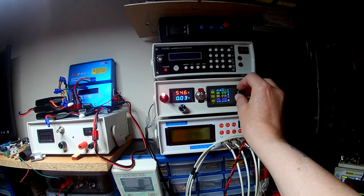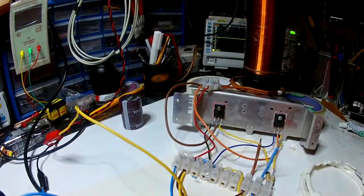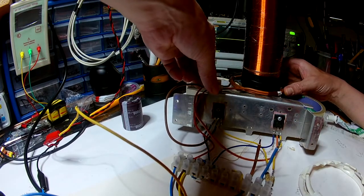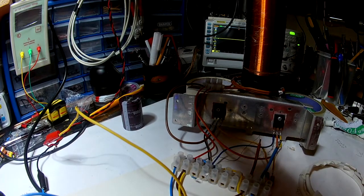Something's not right because I don't actually have any of this on. So that could be a number of things. It could be that this isn't connected in properly, which a lot of the time it will be that. Sometimes it's because this little wire isn't pushed in correctly. Let me just see if I can turn it up again. 3 volts, normally gets up about 6. That's 13 volts, there's definitely nothing there.